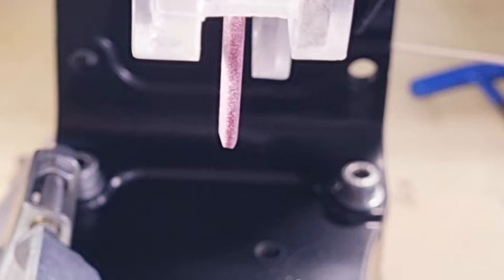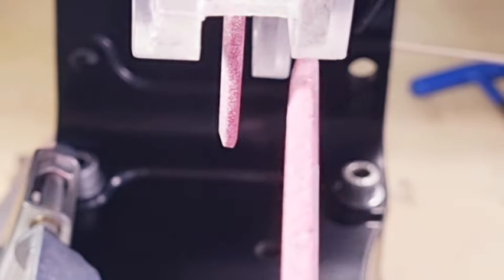Okay, what I'm going to do now is just give you a quick tutorial on dressing your stone using an Oregon grinder. The wheel that I've got in here is a small wheel, 3.2 millimeter, so I'm creating my own hexa for the 3/8 low profile full chisel, so I'm putting a hexa grind on that as well. Same principle applies.